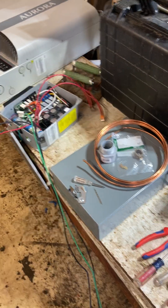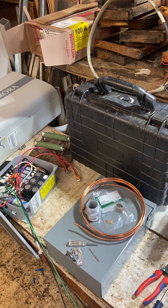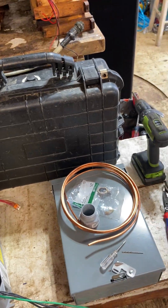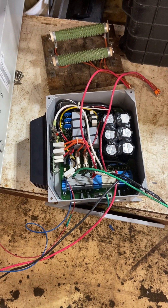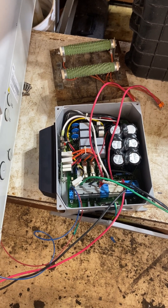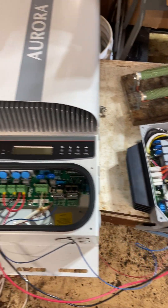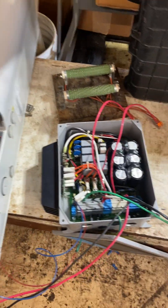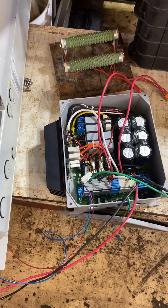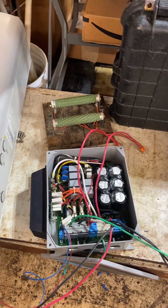Plug and play for Cheryl at Harmony Turbines out in Pennsylvania — hopefully they get their product going. The customer is going to look at getting power from three-phase AC from a generator to an inverter via an interface box or charge controller. Something designed specifically for the wind turbine would be great. Then you need the inverter to either put it to the grid or use the power directly, or use it as a charge controller to batteries and then to an inverter — bypassing the batteries is great because you're cutting out a large expense.